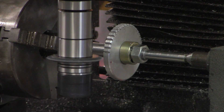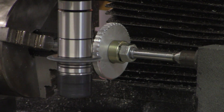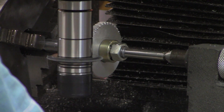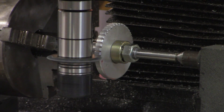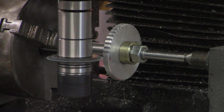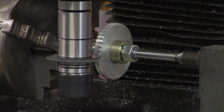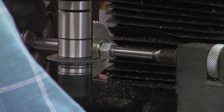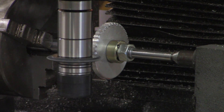Okay, we're fixing to be halfway. What I'm showing you in this clip is real time. This is really no different than using a dividing head, other than turning cranks and counting holes — we let the software that we wrote and the stepper motor on the rotary table do our divisions for us.